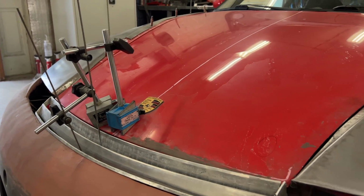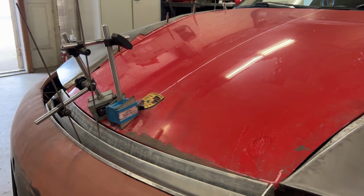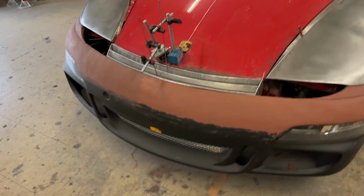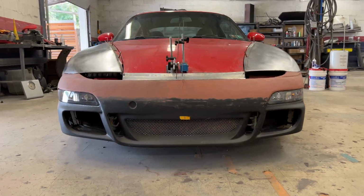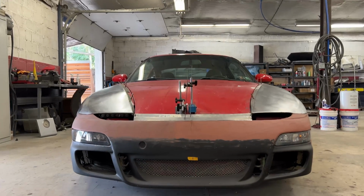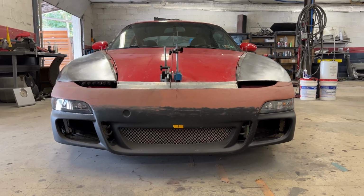There's another Porsche vehicle that has the inset hood with peaks here on the fenders. That's what we took an interpretation of design from. I was thinking it's the 918 that has that, if I remember correctly. With that, if you're familiar with the GT3 or other cars that have the center vents, there's usually a cooler in the front up here that sucks air through and directs air over the top of the car, creating more downforce and less drag essentially. So yeah, that's probably what we're gonna do here.